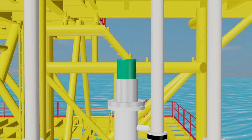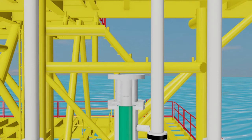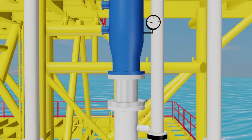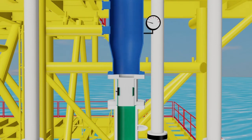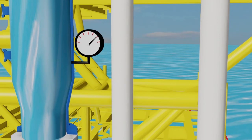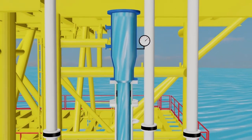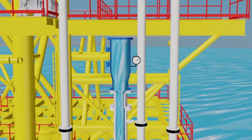The end termination connectors are then located into position and the connector sleeves fully sealed onto the liner. To establish and fully verify that the liner has been successfully installed, the pipe system is then hydro tested at a pre-approved pressure for a period of 24 hours. This pressure is normally set at 1.5 times the current operating pressure of the pipeline.